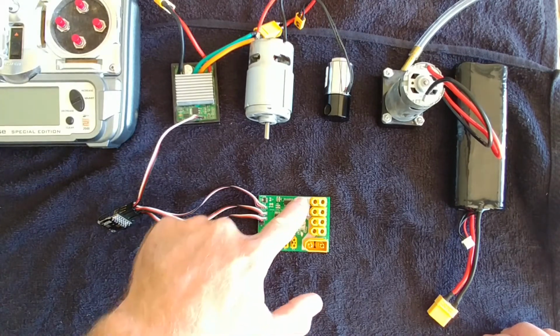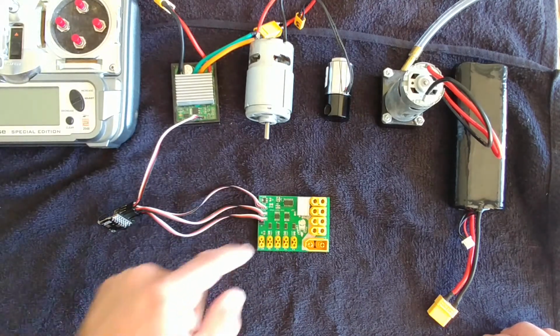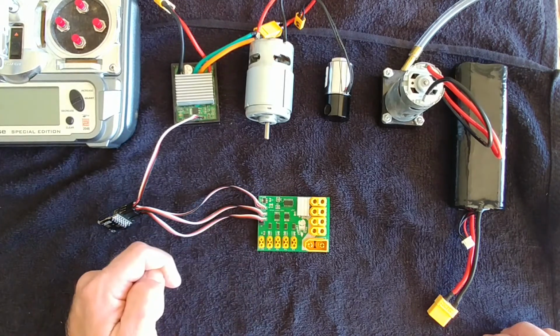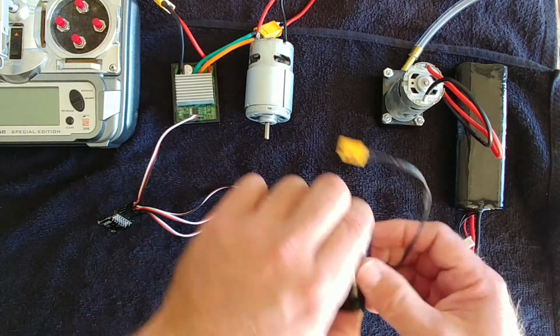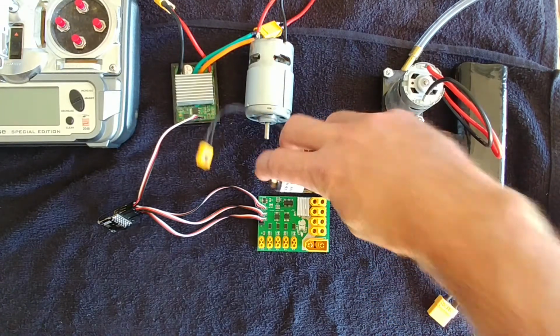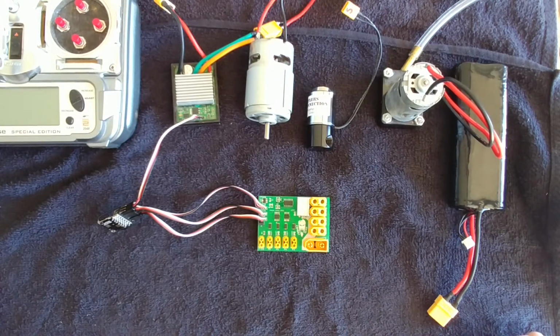You have your pump circuit, which is right here, as you can see, the heat sink and the output port. You have the dual firing circuits, which are these 4 XT30 connectors. They have the built-in flyback diode, so you will no longer need to add the diode in your wire for your solenoid, etc. And as you can see, comparing it to the solenoid, it is a rather small circuit. So a really small footprint to occupy 3 functioning channels and to be a power bus within your ship. It's a great deal to be able to have excess room to reduce components, wiring and weight dramatically.